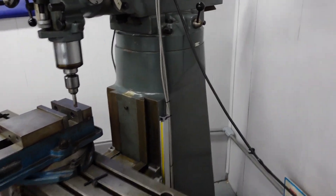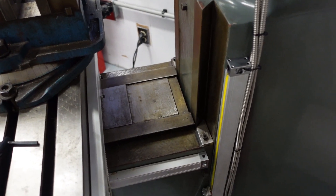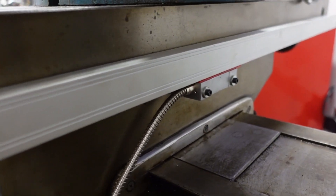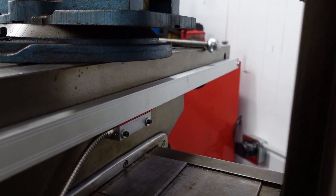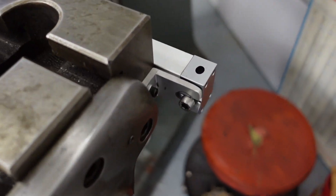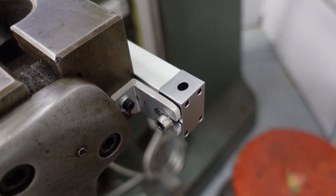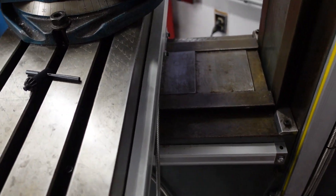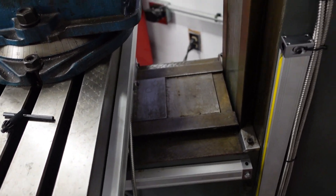The x-axis is all done and I did some cable management as well to keep everything clean, with enough slack so that as the tables move through their range of motion nothing gets pulled tight or pinched. For the x-axis I hard mounted the sliding scale to the bottom piece, and the large scale section mounts directly to the back of the table so as the table moves back and forth it slides over that piece for our readings. I modified some of the L brackets from the kit to make small versions — about an inch and a half on each side — drilled and tapped right into the side of the table with M4 screws. Because it's mounted this way the open section faces down so no dust, debris, or chips can fall into the scale.